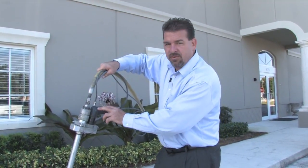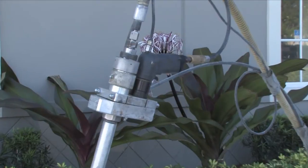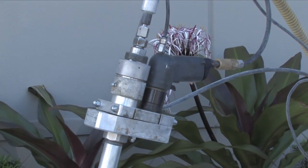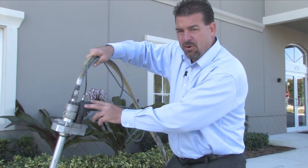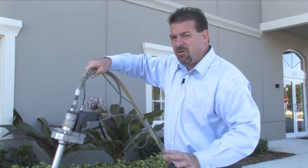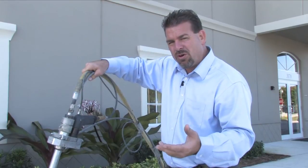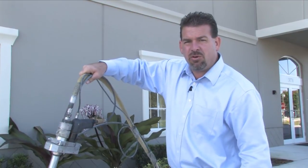Oil lubricates, but water swells the vanes inside these air motors. It's been my experience owning over 80 of these devices from eight different manufacturers without substantial results from any one of them. Different manufacturers use different air motors — it might be Cleco, Chicago Pneumatics, Ingersoll Rand, a variety of them — but they're all the same. They all use the same material for the vanes and they all swell with water. Because it's impossible to remove all the moisture from the air supply, it tears up the air motors in a relatively short period of time.